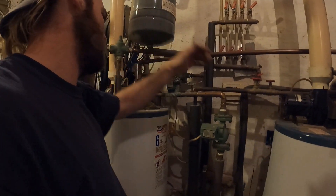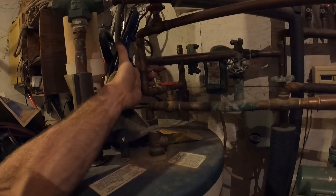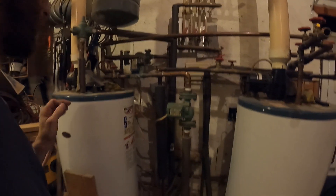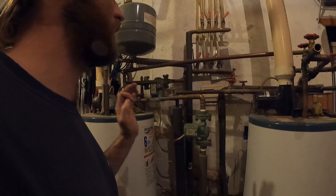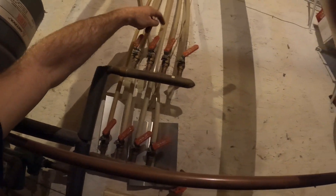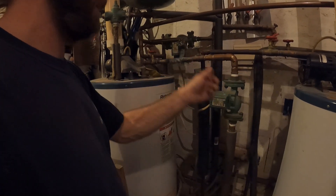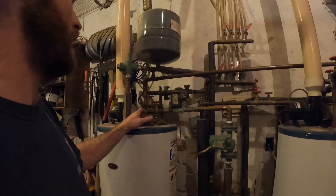Those aluminum trays help put out more heat by reflecting it and extracting it temperature-wise. When this system is up and running I like to have 140 degrees coming through here — pretty hot, you can still touch it. Going back out it's around 105 to 110, so you're losing about 30 degrees between inlet and outlet — that works nicely. Get yourself one of those infrared thermometers; I had one from RC cars and it was priceless. You just hold it to each tube, it tells you exactly what the temperature is, and you can balance the flow or diagnose any cold lines instantly.